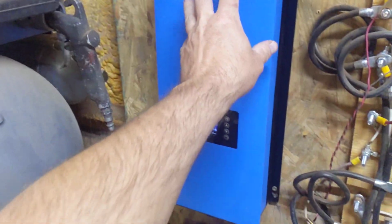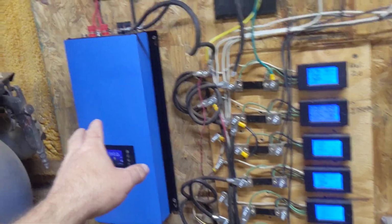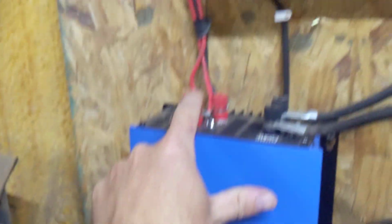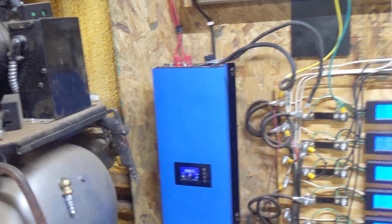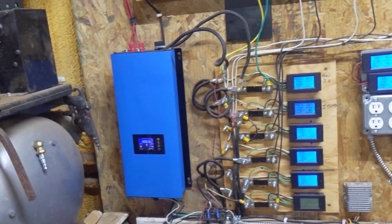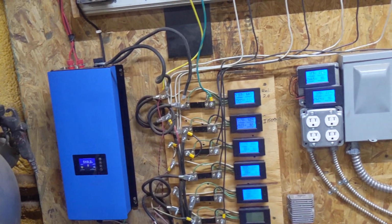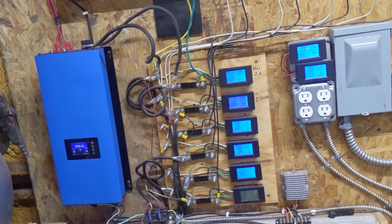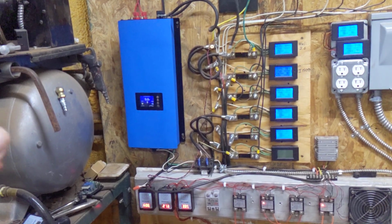This I've only had for a couple of months, and whenever we started with it, it would never release the dump load. See, it's set up to take three-phase input, and this is supposed to be a dump load. But it never turned the dump load off, so the turbines were always fully loaded up, no matter how fast they were going, which means that basically whenever they're idle, whenever they're stopped, it's shorted. It just took too much wind to get them going, and even if they did get going, they'd stall out too early.